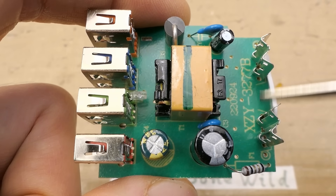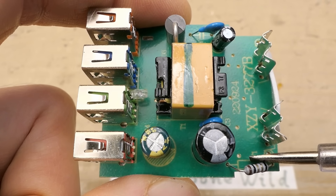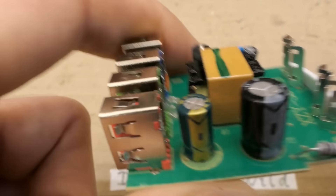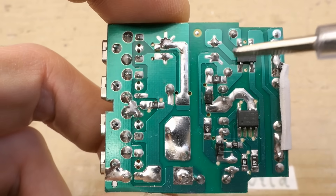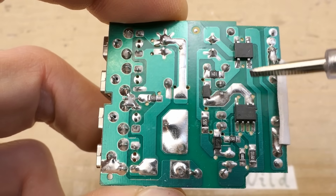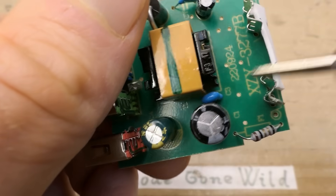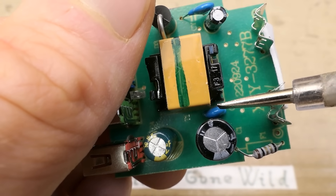Let's take a closer look at the board. The mains comes in here. There's a fusible resistor — hopefully fusible — working as a fuse and also for inrush current limitation. Then it goes into the bridge rectifier. There's no interference suppression. Here's the switching chip, and the snubber network with the diode, resistor and capacitor connected to the primary.